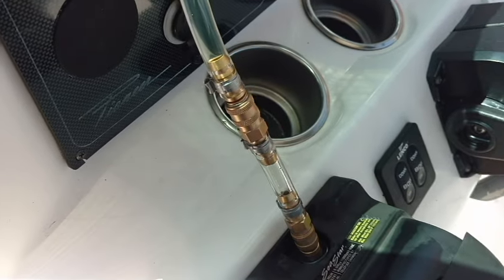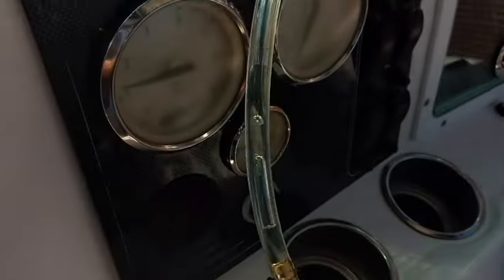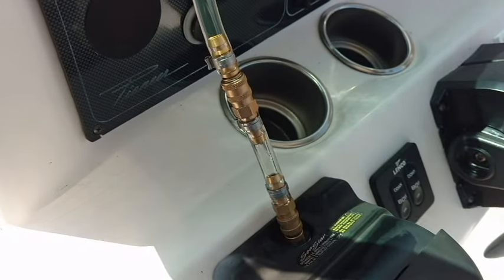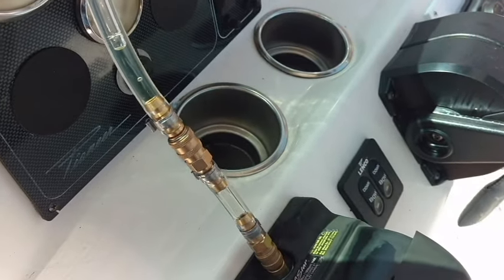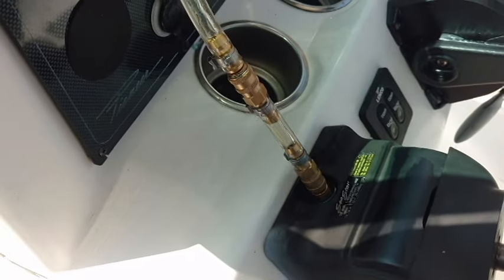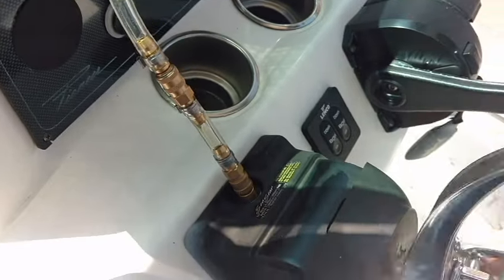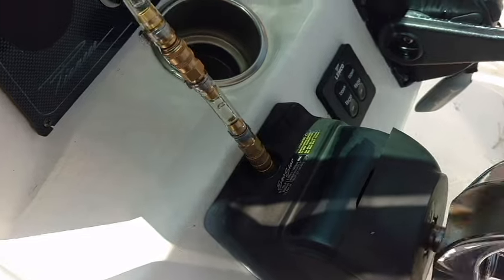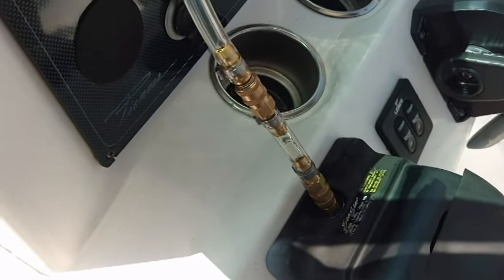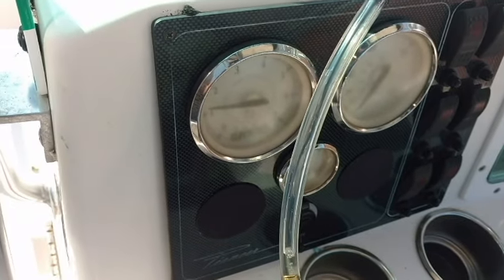We're pushing air and fluid down one line into the cylinder, back out of the cylinder, back into the other side, and out through the other steering hose. Eventually fluid will push all of the air out of the system and push it back into the helm, where it will keep feeding into the bottle. As air pushes into the bottle, fluid drops out of the bottle and goes right into the helm. This is easily the easiest way to do this — definitely the cheapest. You can see air just releasing out of there; all I did was turn the wheel about 30 turns in one direction.